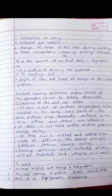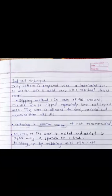To avoid distortion, we need uniform temperature when inserting wax in the cavity. Precautions include: minimum carving, avoiding changes in temperature, minimum storage of the pattern, investing it immediately, and storing in a refrigerator if necessary.